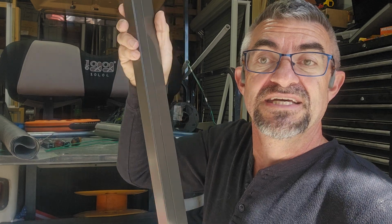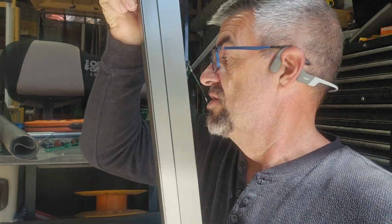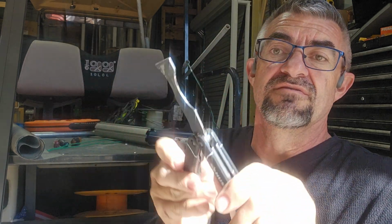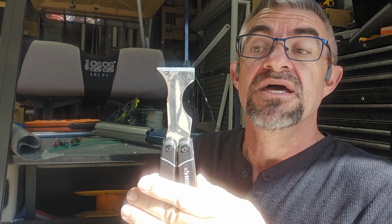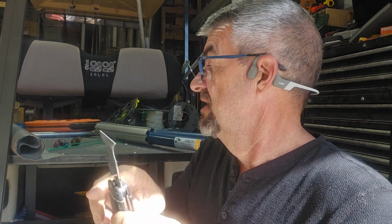But when the shade is installed, as you can see, the track cover is on there. You want to be able to get this off without scratching the track or bending or tearing up the cap cover. So what I have found, and I tell everybody, is the 5-in-1 tool, 15-in-1 tool, whatever it is, it's a scraper thing, kind of like this you get in the paint department. This is a good way. Sometimes it's a little harder to get underneath without damaging.